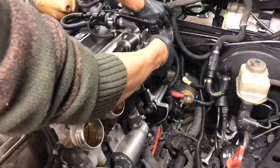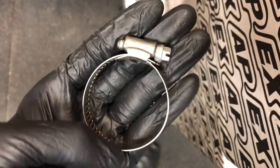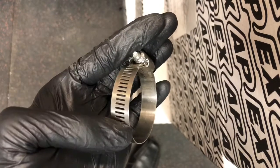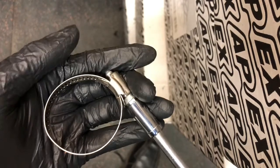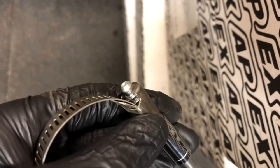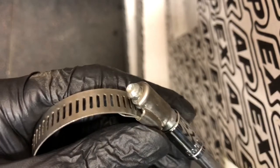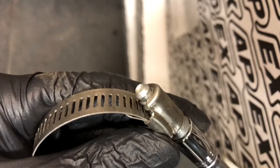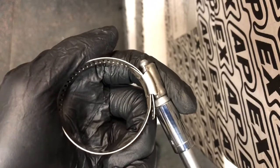I'm going to go ahead and remove the protective coverings so I can show you a close-up of what a hose clamp looks like. This particular size is a medium size, and in order to adjust these hose clamps you would get a socket — in this case an eight millimeter. This spins the worm drive along the band. Clockwise will tighten the band, counterclockwise will loosen it, and as you can see it spins in place. With this socket it is very secure and you don't have to worry about it slipping off.